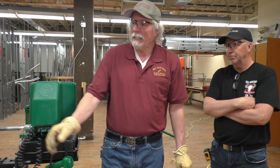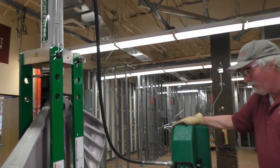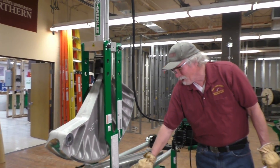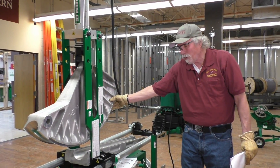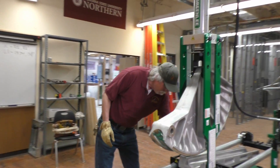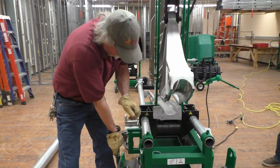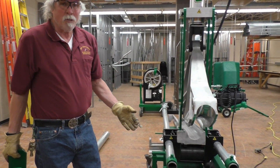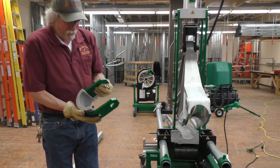What you're looking at here is the unit — the hydraulic ram set up from the hydraulic pump — with the connecting bars. It sets inside this connecting unit. Here's the follow bar. Here's the shoe. And there is a saddle on the unit. The mobile table has the shoes, follow bars, and saddles mounted on it so you can take it anywhere on the job site or in the shop.